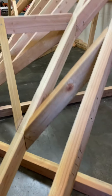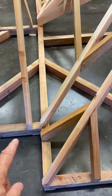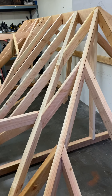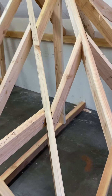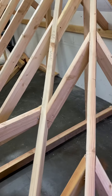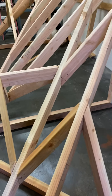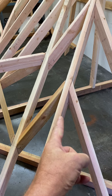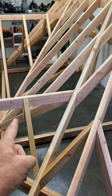The nice thing about these is they're both the same length. So the hip is set down further than the valley — the valley is raised up. There's a lot of what's called a supporting valley, which is what this is, because they want to vault it underneath. And if they put a header there to pick up the weight, all the weight of that entire thing would just be on this one hip here on one side, and on the other side it would be on a jack rafter.